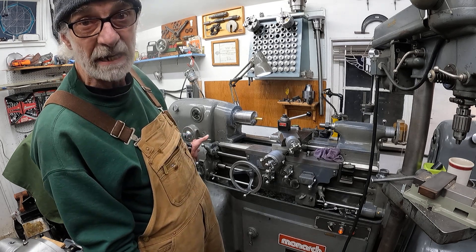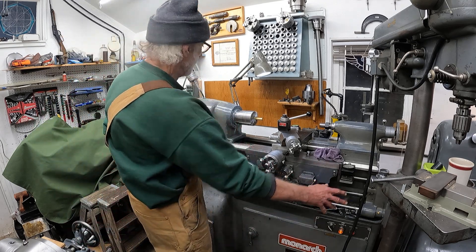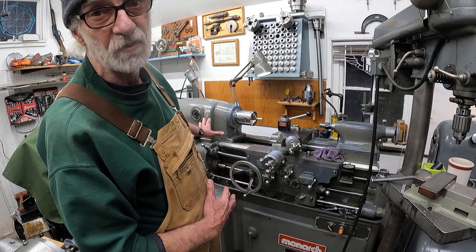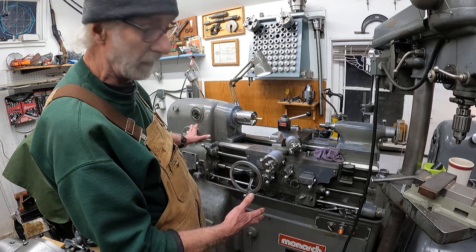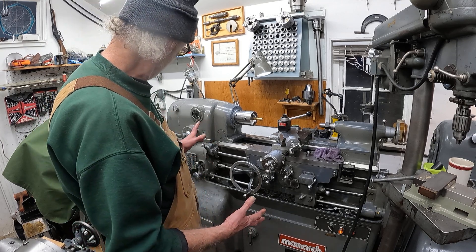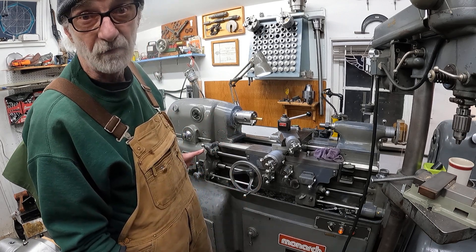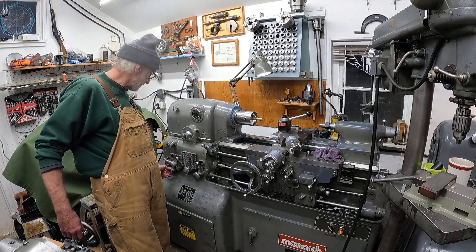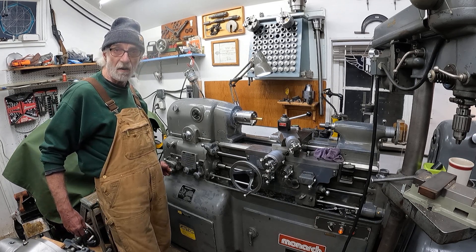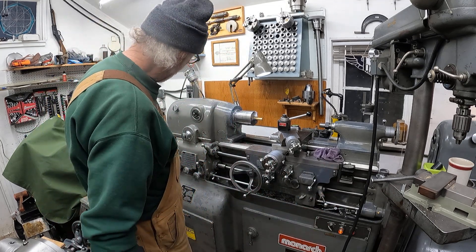When I stop the machine, the dynamic brake will kick on — two seconds to stop. I don't like to start the machine at full speed, it's hard on the electronics. I've run this thing successfully for 20 years without goofing it up. The tip is: it's a good idea to back it off to below 1,000 for starting. I have a dab of paint right there at about 600-700 RPM, and that's where I start it. It starts real happy there and ramps up rapidly.